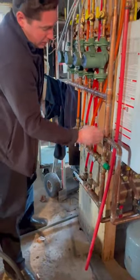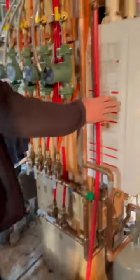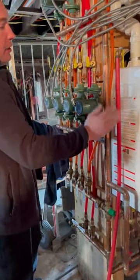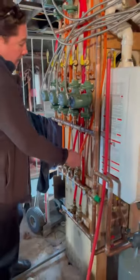I'm not getting enough temperature. Basically, right here in the feed, even though it's 120, the boiler is short-cycling. It'll run for about a minute, and then it turns off for three minutes. So I'm wondering why I'm not getting enough flow.